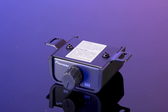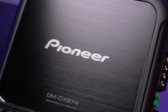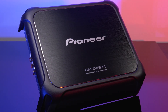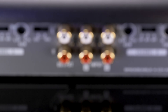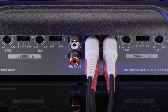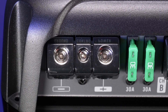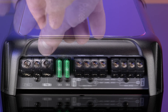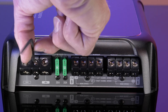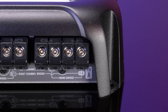Like all GM-DX models, you'll get a brushed aluminum finish with the same cast housing as the regular GMD models. The GM-DX models feature gold-plated RCA inputs and upgraded internals. On the connection side, we have power and ground terminals that will accept up to four-gauge direct wire inputs, remote turn-on, and up to 10-gauge for speaker outputs on all four channels.